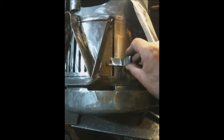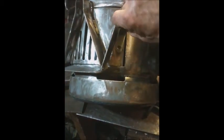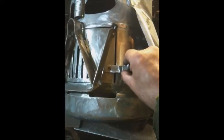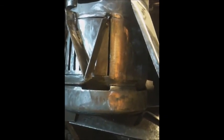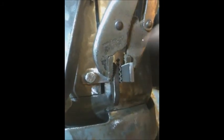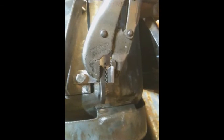Well, the hole drilled in that, you can see what's going to happen here. That's going to be a swivel point with a simple hook catch on this side. I'm going to crack on and get that hole drilled in, get that catch welded on. I've cut my handle, formed some sort of bracket, put a little spacer piece in between, and clamp that together. To get that level, I clamp that with a pair of mole grips, position it something like that, and I'm now going to weld this on here.